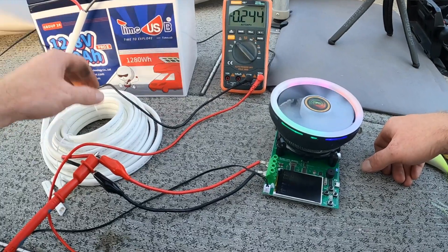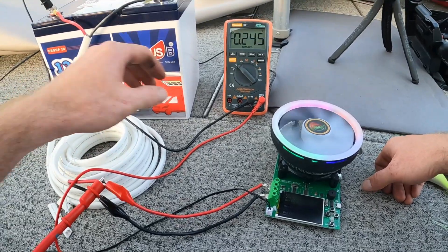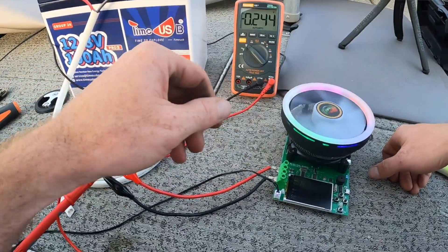If I had 25 feet of 18 gauge wire, that would probably be a volt and a half, two volts — it would be much higher. This is 10 gauge and that's a quarter of a volt. Maybe you don't want that quarter of a volt — that's not a small number. That's the difference between 12.8 and 13.0, or 13.0 and 13.2. That's the voltage we're losing along the circuit.